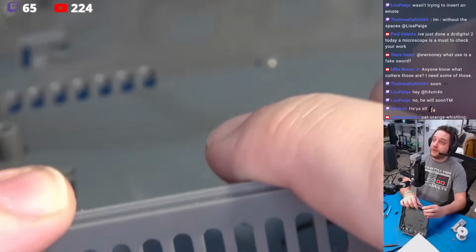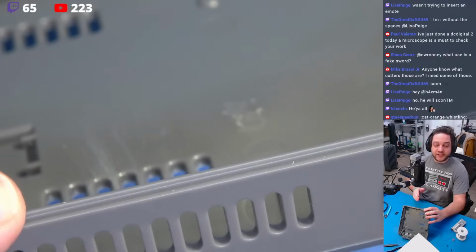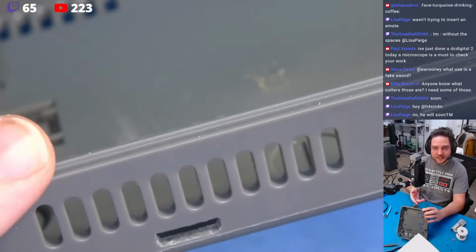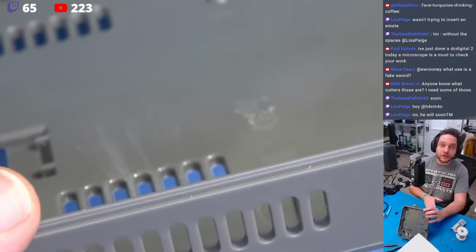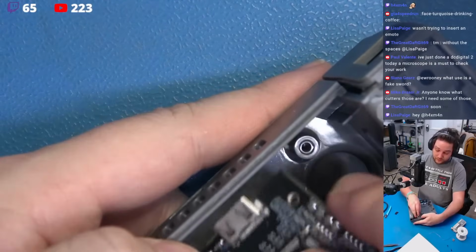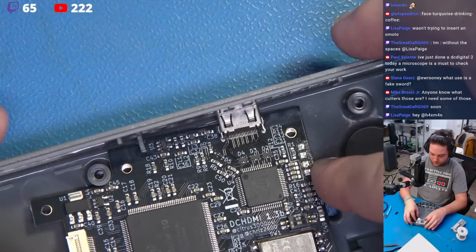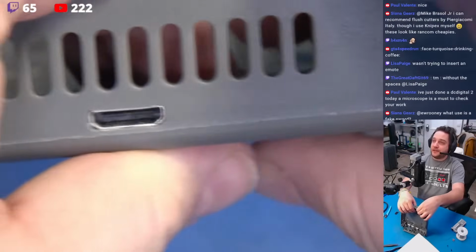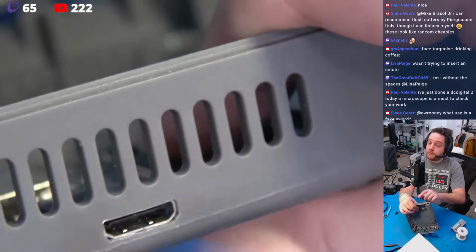This port that we're creating is already super small. It's best to freehand this if you have the time, in my opinion, because when you freehand this, you have relatively tight control of where you're removing material and where you're keeping material in place. Now, what I did is I freehanded this port, and when we put this in position, there's this little notch here that the kit fits into, just like so. When I get this in position, you'll notice it doesn't want to go. It's nice and tight because I freehanded this port so that it is virtually perfect as can be for our kit.